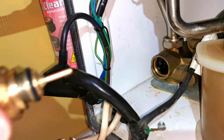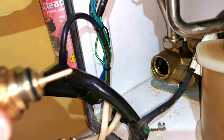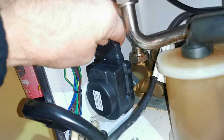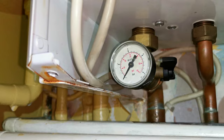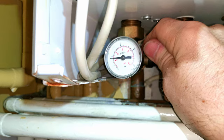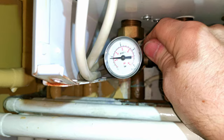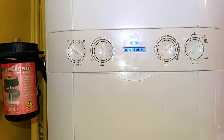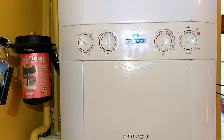I'm just going to clean off the rust mark off the bottom here - if the valve decides to leak in the future I'll be able to see if there are more marks. Then it's just a case of putting it back in the diverter valve and doing it up. I fit the new head, put a bit of grease on the retaining clip, and the electrical plug only goes on in one position so I just line that up and plug it on. Now I can refill the boiler with water and check its operation. I'm topping it up between 1 and 1.5 bar and I mustn't forget to open up the flow isolation valve which I closed earlier to stop the central heating water coming out whilst I was changing the diverter valve. I've got quite a bit of air washing about inside the boiler so I'm going to the auto air vent and just opening up that cap. Once I'm happy I've got all the air out and good circulation I'll close the cap again, as they do have a habit of leaking.